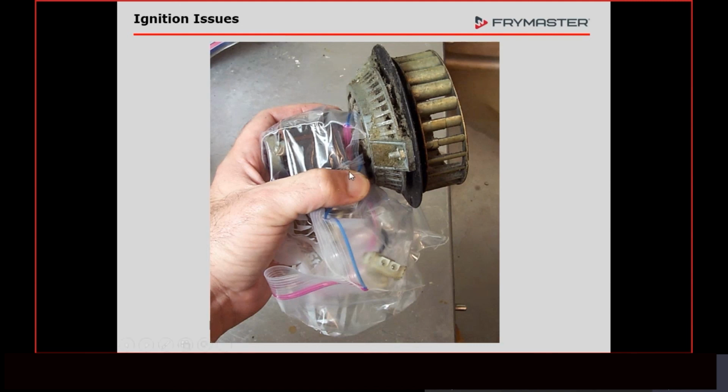If that relay starts to wear out, or this blower motor is slow to react, that results in popping. And popping, or that backfiring, is going to do damage to the burner. If those burners then need to be replaced, this blower motor, I don't know what it costs anymore. We don't sell parts directly from here, so I don't keep up with that as much. But I guarantee that blower motor is not as much as a new burner job.